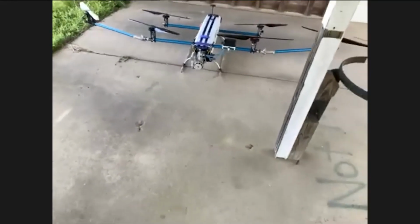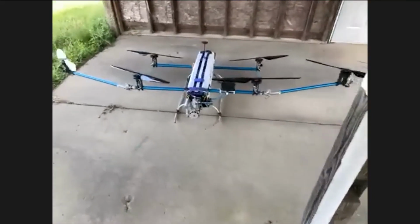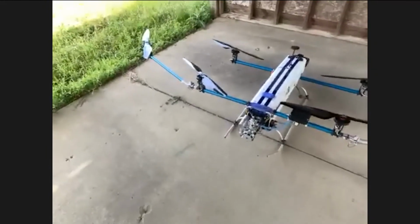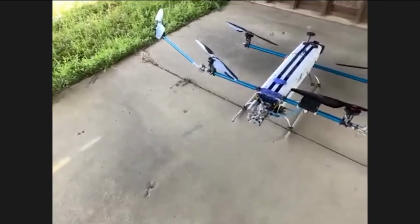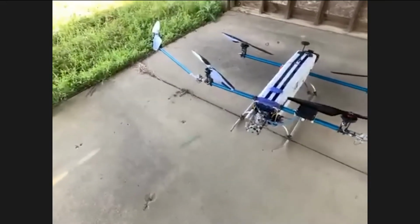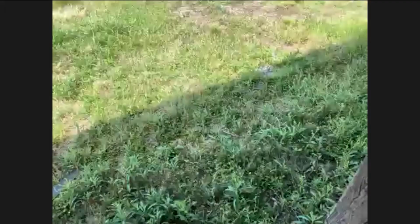So assuming there's a situation, you can just break out of that mapping mission? Yes, absolutely. At any point, you can pause the mapping mission or delete it. You can just grab the joystick, and as soon as you grab the joystick, it senses that the pilot's giving inputs and automatically changes flight modes over to position control. Let me flip around so you guys see me. Position control is a lot like DJI, where you're just commanding the translational velocity across the ground, and the drone flies itself to stay over that target location. But yes, at any point, if it's doing something you didn't expect it to do, you can take over manual controls, give it new instructions, and manually fly it.